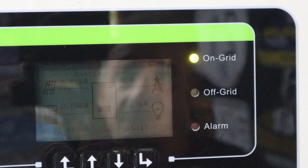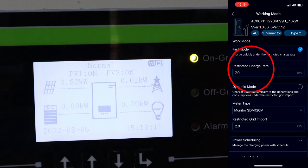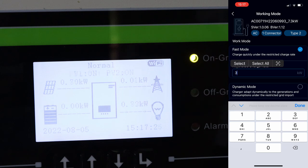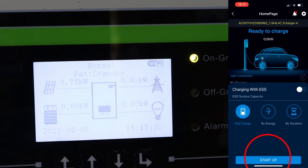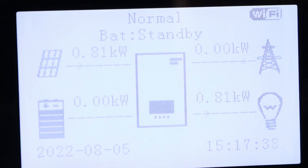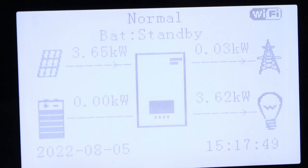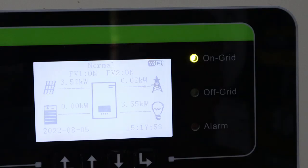With a little more playing around, if I set my maximum charge rate to 3 kilowatts - I know I was actually drawing about four and a half kilowatts from the solar - I can press start and in theory it should only draw 3 kilowatts. And that should be plenty just off my solar panels. There we go - 3.65 kilowatts - nothing coming from the battery and nothing coming from the grid. But you need to keep an eye on the sun at that point because as soon as a cloud goes over you need to rush back out and turn it off.